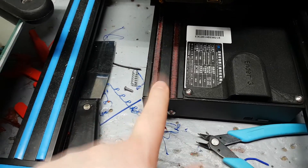A little bit of sanding and burning off the excess turned out pretty well — I'm actually happy with these. It's been a few days after installing. What would I have changed? I would have printed them all laying flat on the bed because I have a flex bed, making it easier to remove prints. And I would have done maybe 100% infill rather than 20% infill.